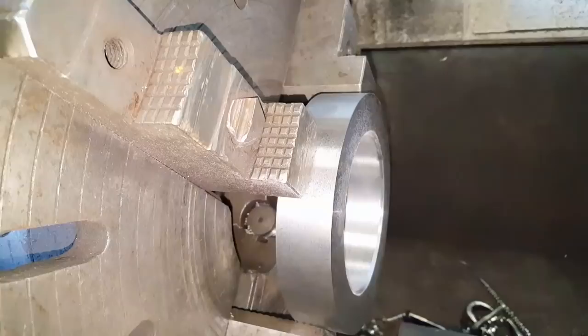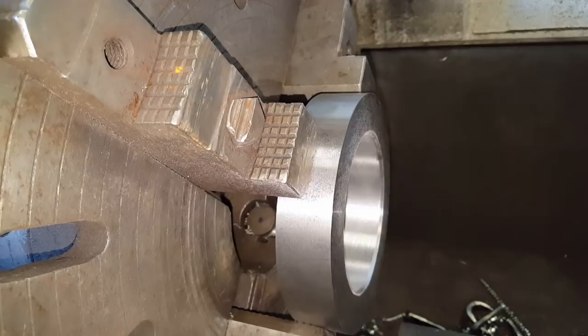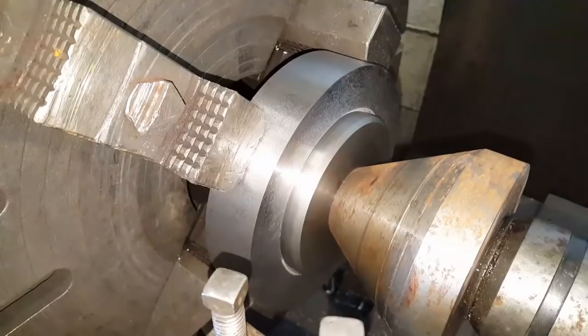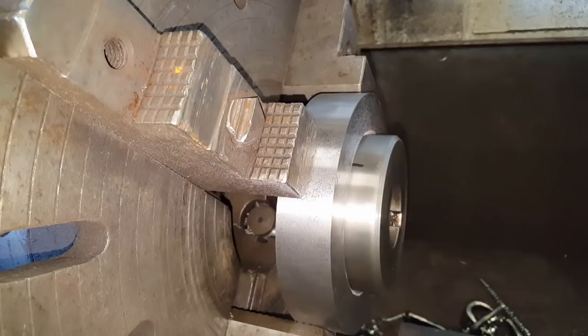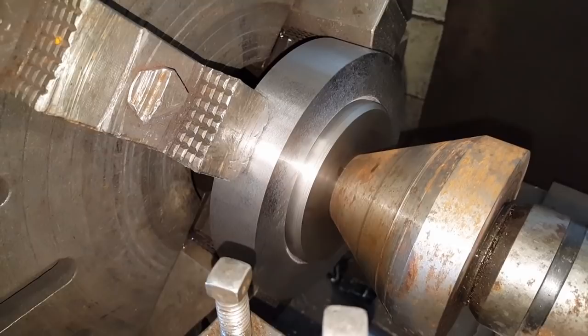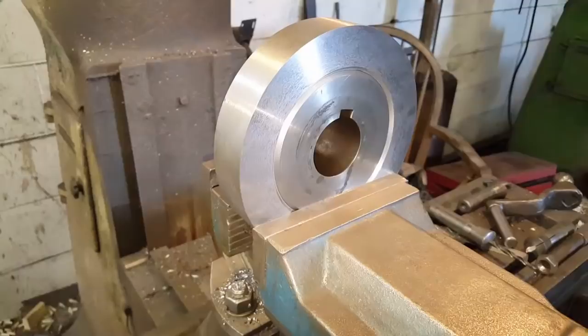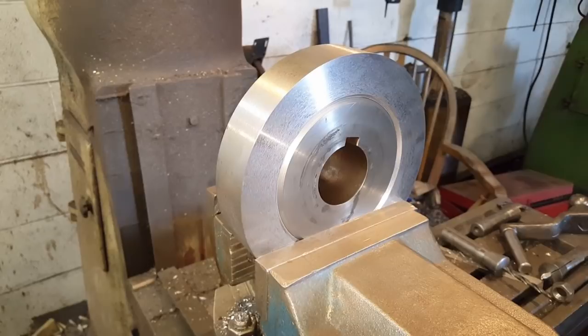I need to show you what I mean - this way it won't fit, but this way it will fit. That'll press into there nicely. That works out brilliant. I had to finish it on the vice - I couldn't get enough pressure on the lathe tailstock - so pressed it in on the vice.